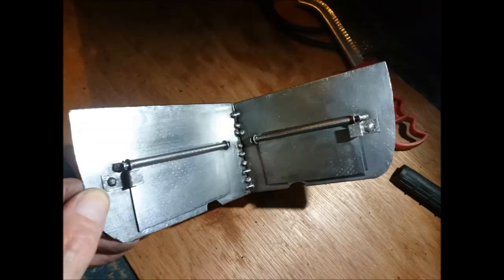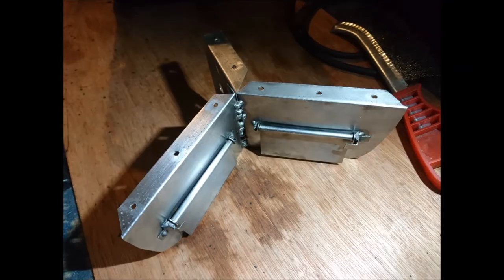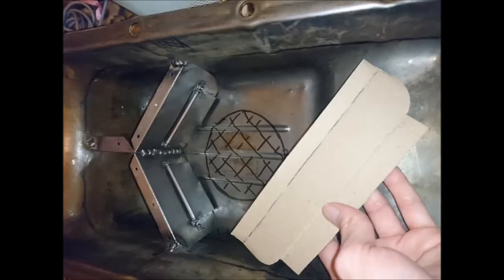This next shot you can see the stoppers. These stop the hinges at about 30 degrees of opening, which also prevents them from hitting the oil pickup. Even though they are very light, you don't want them constantly hitting the pickup. There is a chance they could partially unseat it from the block and then you will lose your oil feed, which is not a good idea.